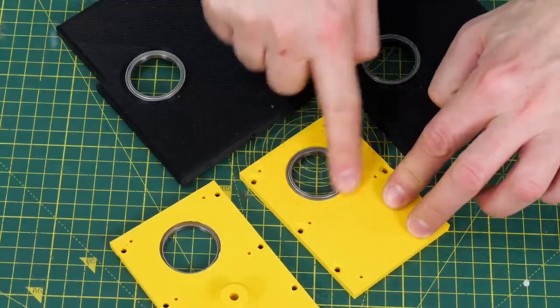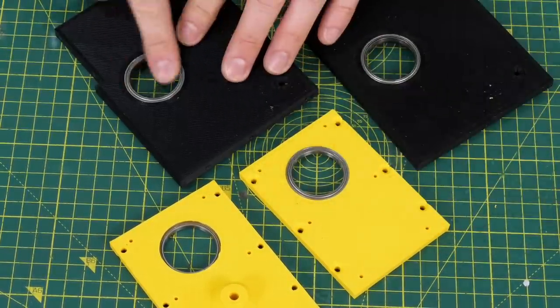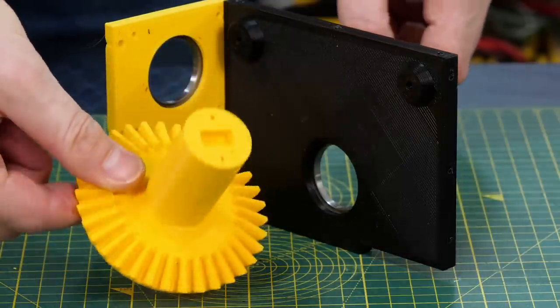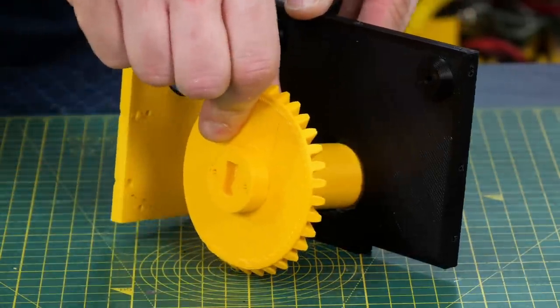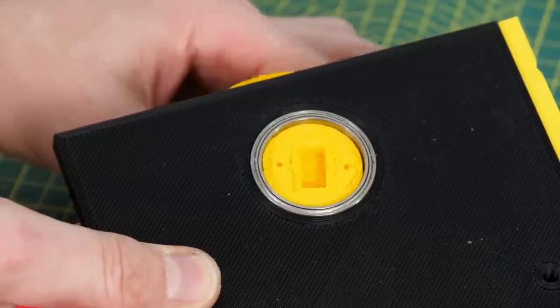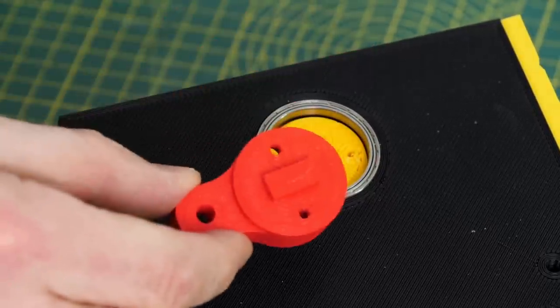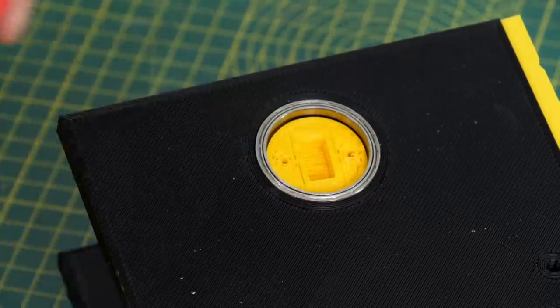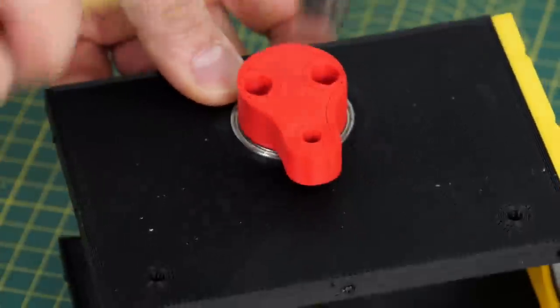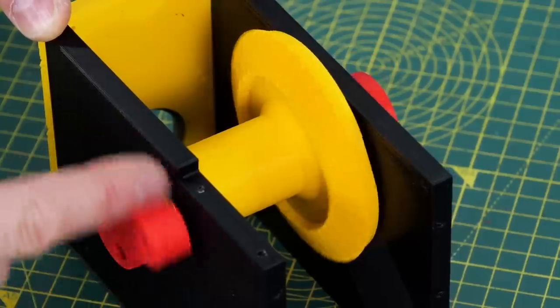Each segment is basically a box with 4 sides and I've got those slimline bearings embedded in recesses. My bevel gear fits in there between the two long sides and the other side fits on to support it at the other end. Those bevel gears have got recesses in each end and that allows a keyway to fit, which is for the cams that are actually going to drive the leg mechanism on each side, and those screw on as well.